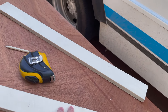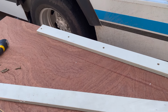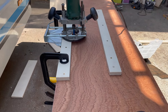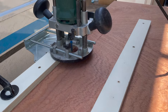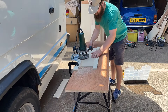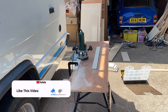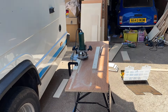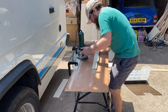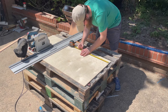To achieve this I grabbed a flat piece of scrap and two 15 millimeter high pieces of plywood, screwed one piece to the back, then another piece the same width as my drawer sides and fronts, before attaching my router. This allowed me to basically sled through each of the sides and fronts to cut my dado. I cut mine at five millimeter depth because I have 15 millimeters to work with, giving a nice sensible groove for the drawer bottom to fit into. I decided to cut the drawer bottom from nine millimeter plywood I had in the garage.